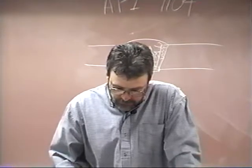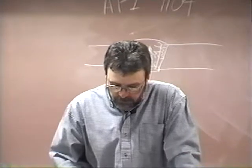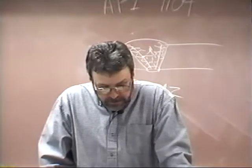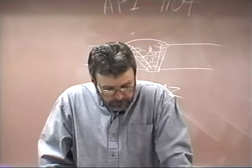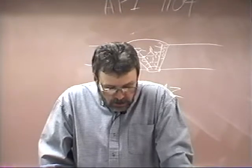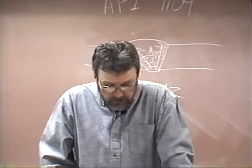Reading this topic, it says, in the field, the sections of pipe to be welded together have usually been beveled in a shop before they arrive on the job. Should this not be the case, then it will be necessary to cut and bevel with an oxyacetylene cutting torch and a grinding wheel. The surface of the bevel must be ground smooth, and all traces of the tightly adhering oxide coating left by oxyacetylene cutting must be removed.